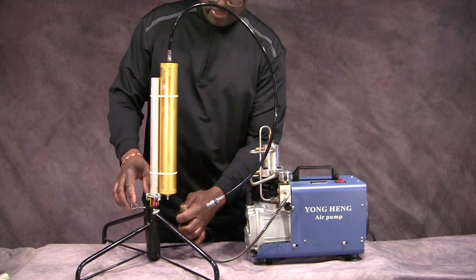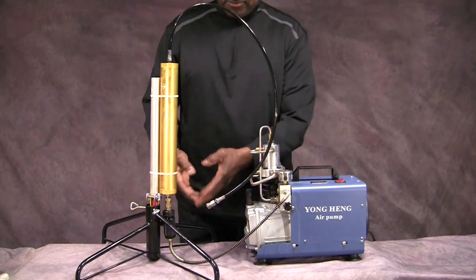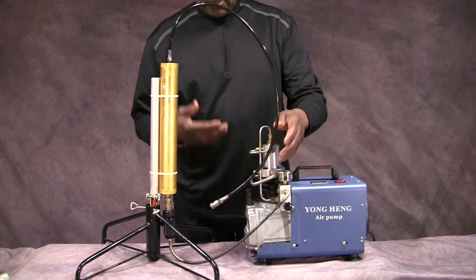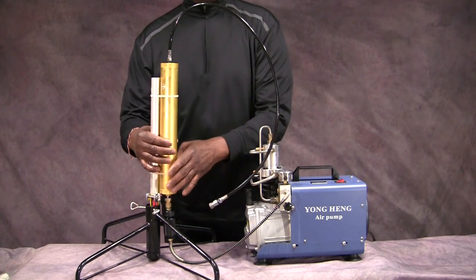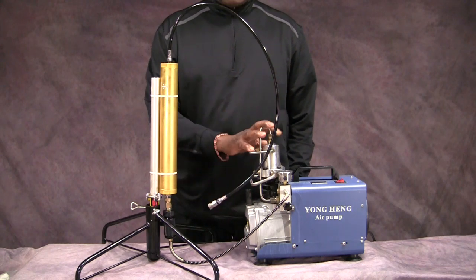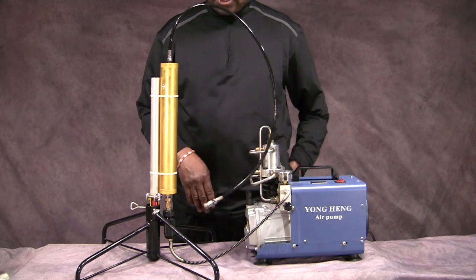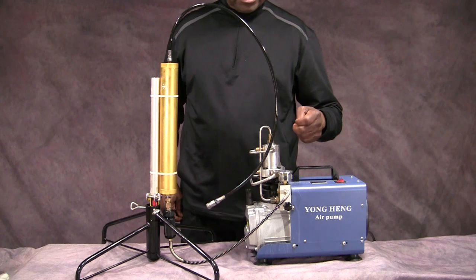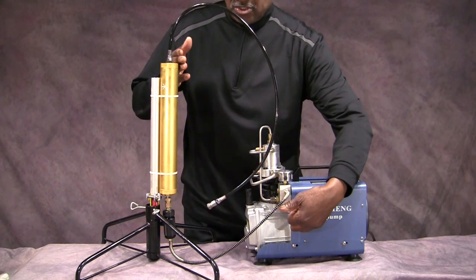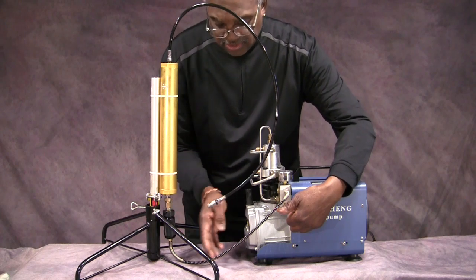Now let me tell you how best to keep water out of your system and how this will work. It's going to be attached like this — you start your compressor up, hook it to your source, and fill whatever you're filling. When you're finished filling, everything will be pressurized. I never go past 3,500 PSI on mine — it says 4,000, but I don't want to stress the system. So I fill at 3,500 PSI, which is more than enough for me. Now when I get ready to purge the system, I'm going to purge it from right here. When I turn this, all the back pressure up here is going to shoot down and force — hopefully it's water — that's down here and in here, down and out.